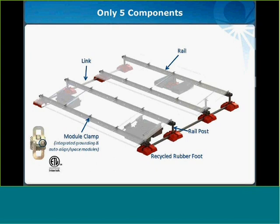Lastly, the module clamps secure the modules. We call them intelligent because they space and align the modules automatically. There's no measurement required. The clamp also grounds and bonds the frame of the module to the system. So because of that, we only require one grounding lug per subarray, and that can go in pre-punched holes in the rail. So this means that the system conforms to UL 2703, and that's certified by ETL for any module